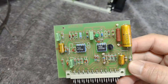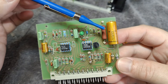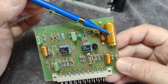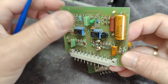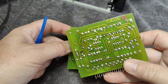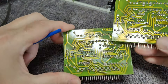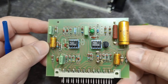There are a few things I want to show you on this design. The first one is a power resistor right next to an electrolytic capacitor — that is not a good idea. It could have been moved a little bit away, so now this one is going to have a shorter lifetime. I will change those. You can see the circuit board traces in this area are a little bit darker, which just reveals that this power resistor is not there just for looks — it is running a little bit warm.